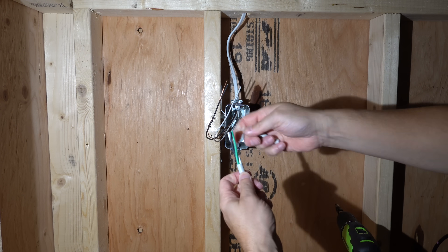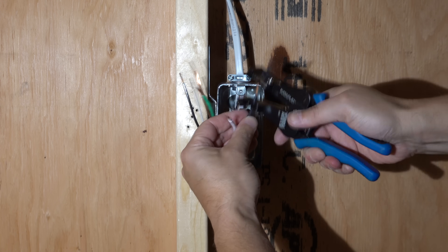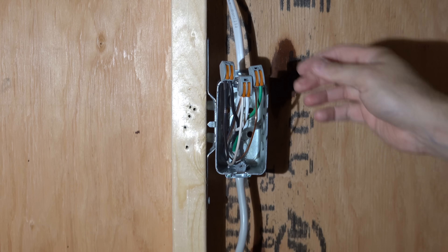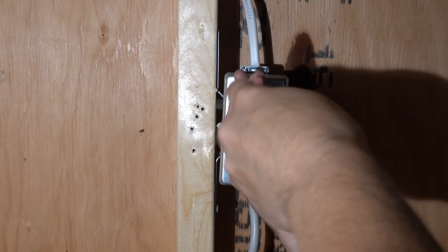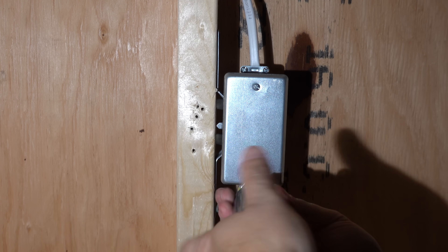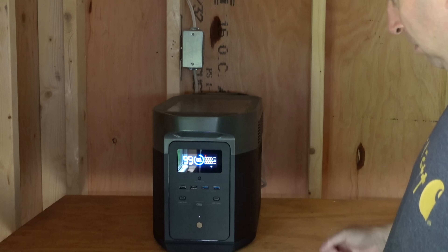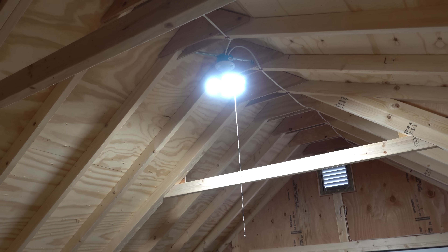The Romex feeding all the fixtures has a hot, a neutral, and a ground, and I just need to match them up and connect them together using those same wago connectors. With everything connected, I push the wires back into the box making sure the holes are facing down in case any water gets in — that way it wouldn't just collect inside the connector. To connect everything up, I just plug that new cord into the back of my solar generator. With the outlets turned on, the lights come on and everything looks like it's working fine — that light is super bright.